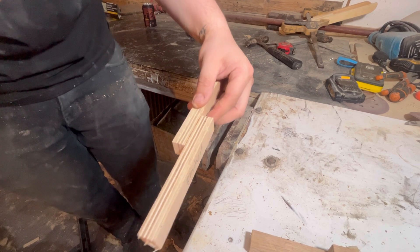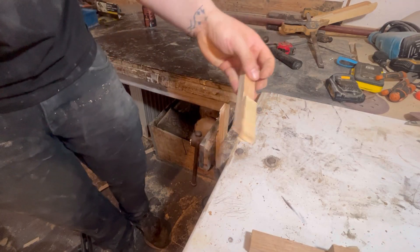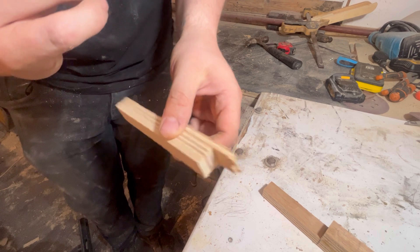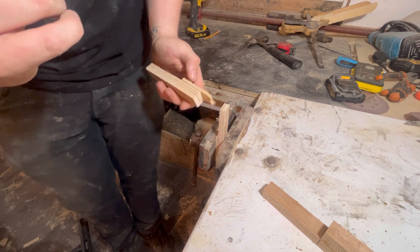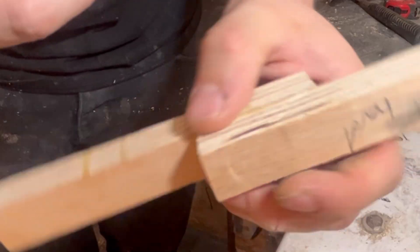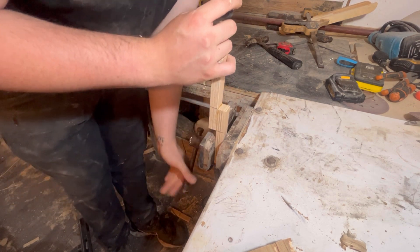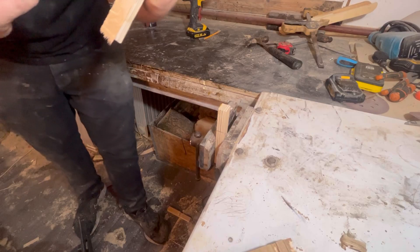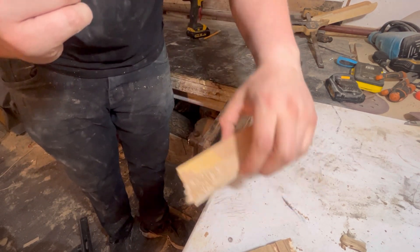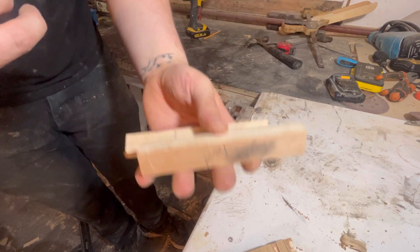This one is the pinched-up-in-clamps version. Let's give it a pull. That broke a lot harder and a lot more of the plywood came off — the wood glue may have seeped in even more because of the pressure. And this is the one where we wrenched it really hard — you can see we actually bent the plywood, and this is hardwood plywood. Let's see if it's a dry joint. Yeah — that is a dry joint, barely any force needed, and it broke along the glue joint.